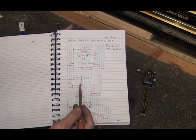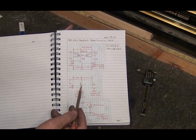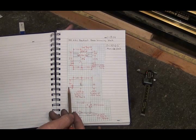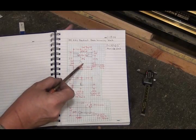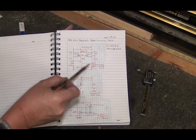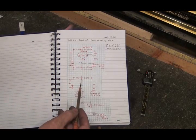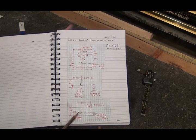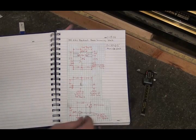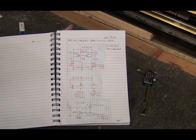This little circle here is going to be cut out down to where it's only a quarter inch thick on the bottom, and that's where the brass will lay. You put the brass in there and shove it through this hole and chop it off. That little hole there is the set screw coming through, and this hole here is the 3/8 hole for the brass to go through. I've got three drawings here from three different angles.